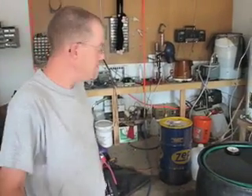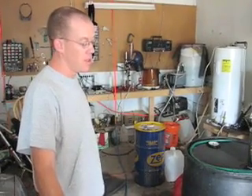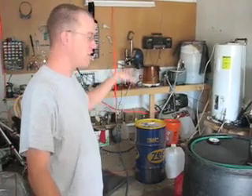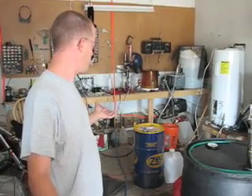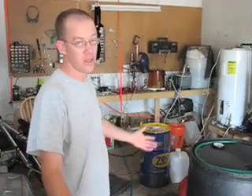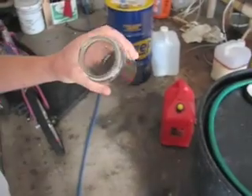What do you do with the glycerin? The glycerin is essentially soap — kind of like Gojo — but it also traps the methanol from the process. You can't use it as soap because the methanol is poisonous. What I intend to do — what I got these metal barrels for — is heat it so you can fractionally distill off the methanol and reclaim some of it. If you heat it to about 135-140 degrees Fahrenheit through a condenser, you'd get some methanol out. Then with none left in the glycerin, you could pour it through a t-shirt-type filter and use it essentially as soap — which is what this hard glycerin is, once all the methanol has been burned out of it.